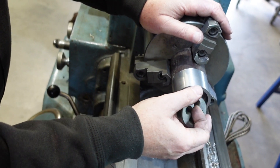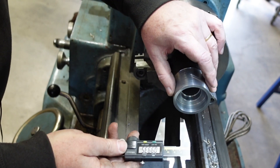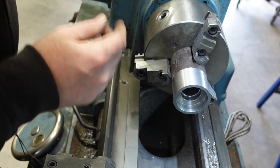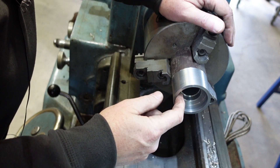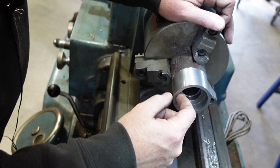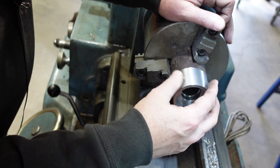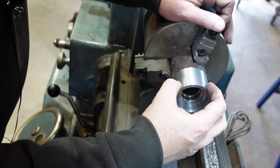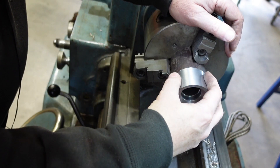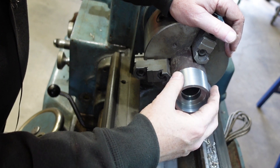It's a little bit too loose for my liking, but that's why it works. The problem is that on the die stock I've got there's about 10 to 11 millimeters of thickness, but here there's only five - I don't think that's going to be strong enough. It looks like they're trying to get something like two diameters worth of thread for the securing bolts. So what I'm going to do is make up a ring that I'm going to shrink-fit onto that, which will give me some extra meat to work on. I've cleaned up the outside in anticipation of that, so I've got a nice smooth and concentric surface.